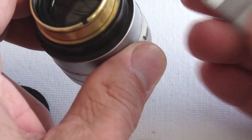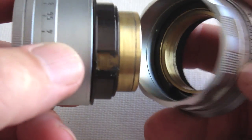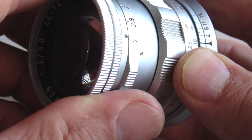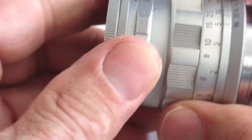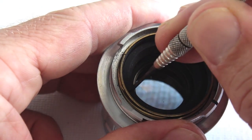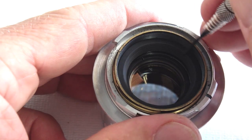Now insert the lens group assembly into the focus barrel assembly. Align the groove on the lens assembly with the post in the focusing barrel assembly. Once the proper alignment is found, the two pieces will slide together nicely. Drop the final retaining ring in place. Seat, start, and tighten in the same manner demonstrated earlier in this video with the inner retainer ring.